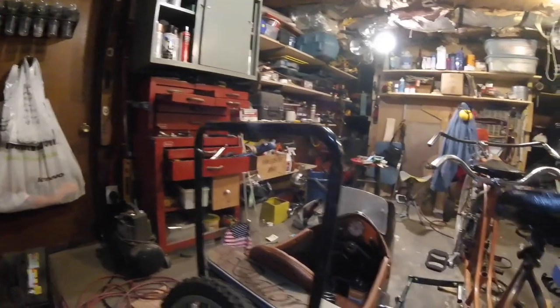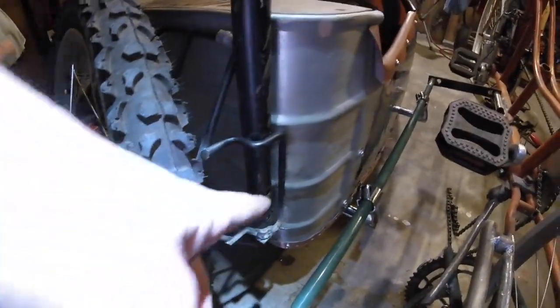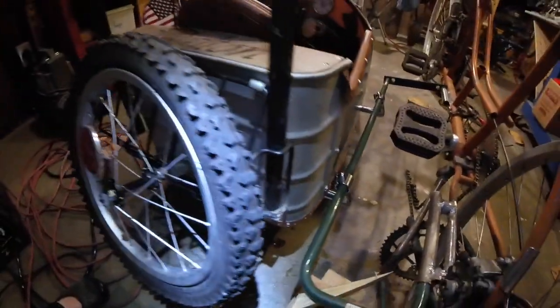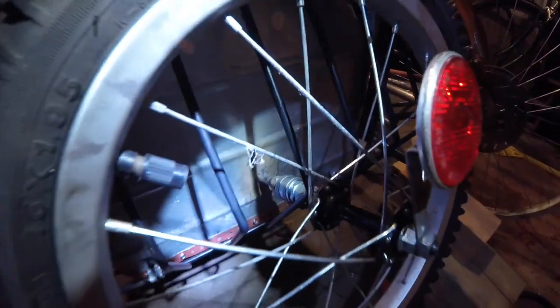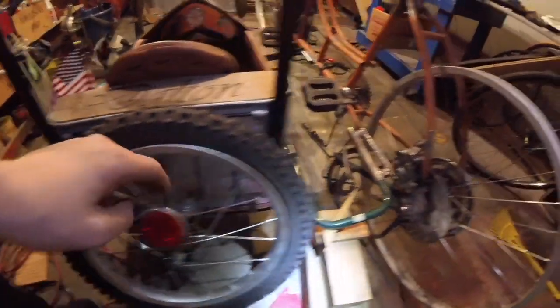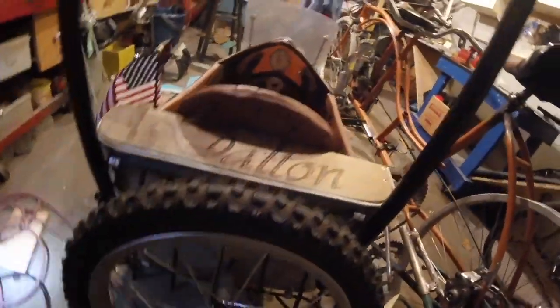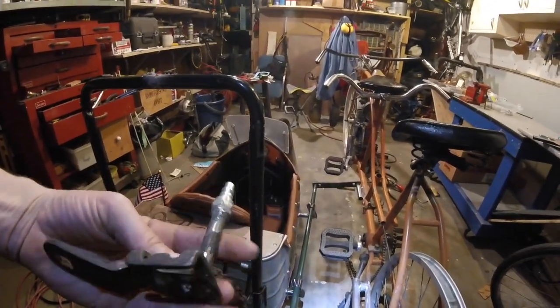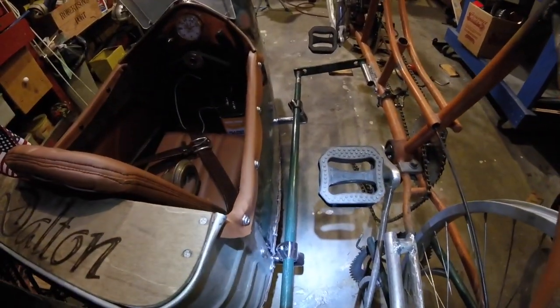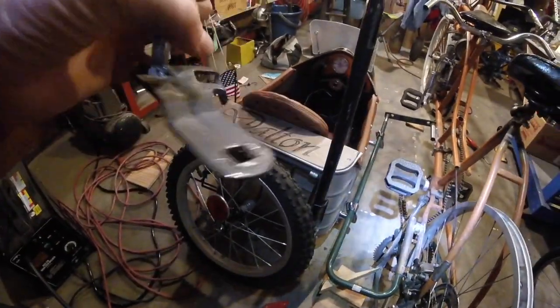So I've got that welded up. I welded a couple of corner plates down the bottom. I barely hit on that one, so I may have to bend that pipe out or cut a new one. I'll grind these corners and edges a little cleaner. Got the quick connect wired up to the back of the car there, so to put the buggy wheel on, you just quick release that, and there's a spindle that goes over here that I welded up tonight. That will bolt between the two rail holders to put the wheel on when it's in stroller mode. And actually, this just bolts to the bottom. It doesn't have to be welded. So that's ready to go.